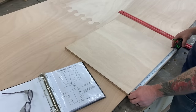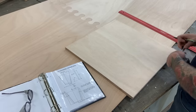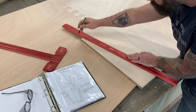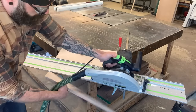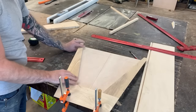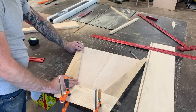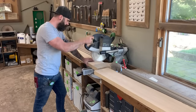While that was drying, I moved over to start working on my transom. If you don't know what a transom is, that's okay — neither did I. It's a nautical term for the back portion of a boat, where the two sidewalls or hull come together and attach. I made my transom according to the plans out of three-quarter-inch marine grade ply. After drawing out the general shape, I cut out my beveled edges using the track saw, and then I braced the entire transom with ash. The entire ribbing and internal structure of this boat will be made in ash — also the first time I've ever used ash, so there are a lot of firsts for me on this one.